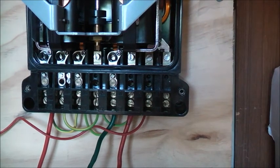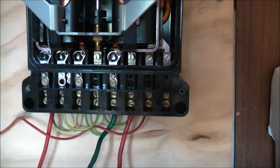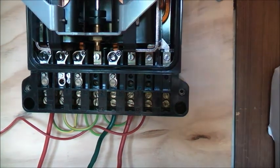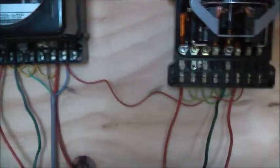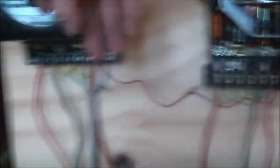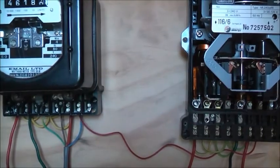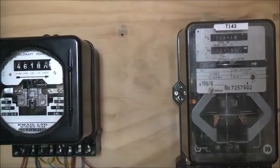I see odd fingerprints on that load wheel too — they have definitely been handling it when I re-certified this thing. I'll put the cover back on and proceed with a test. It's obviously going to be a bit faster, this one, because this is 66.6 revs per kilowatt hour. And this is about half that at 35 revs per kilowatt hour, so there's going to be a bit of difference here. Alright, let's proceed with a test.